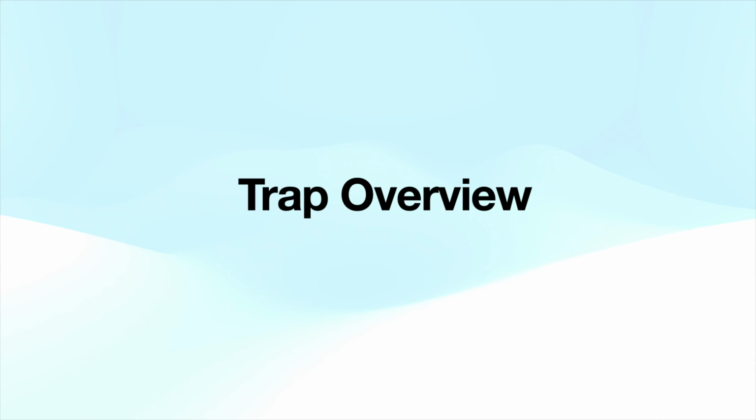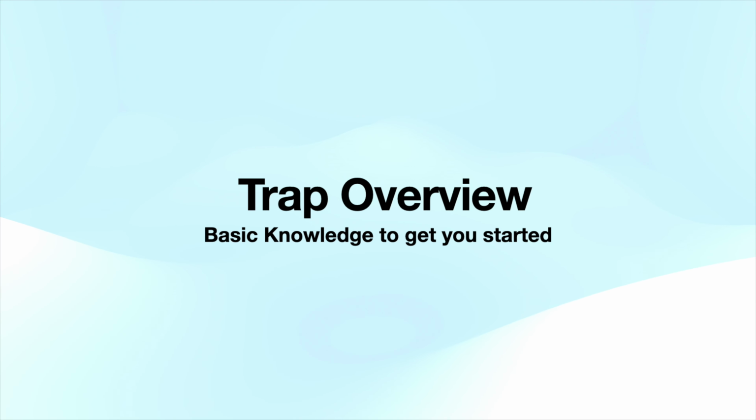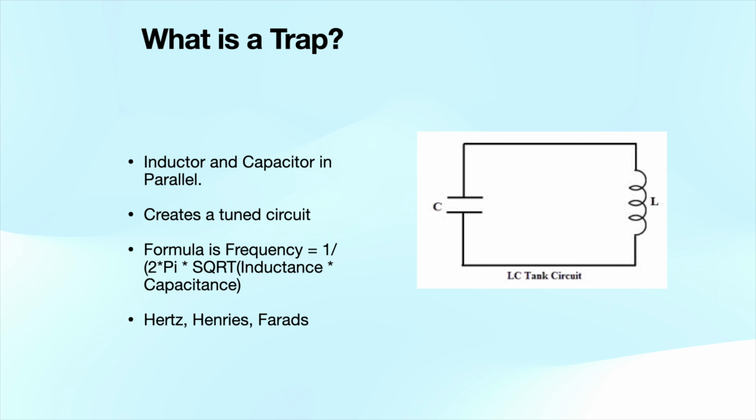All right, this is just going to be a quick trap overview. I don't want to make a huge course out of it, just basic stuff to get you through this build. So what is a trap? A trap is an inductor and a capacitor in parallel. It creates a tuned circuit. The frequency is in hertz, henries, and farads, so you have to do the conversion on that too. But there's a cool tool that we can use to do that for us.